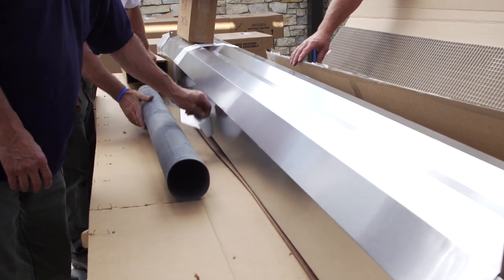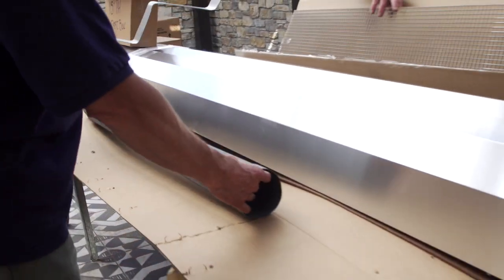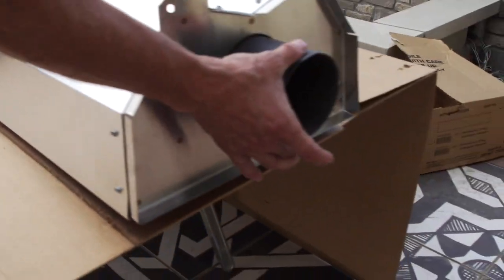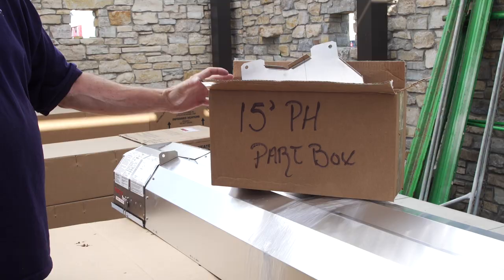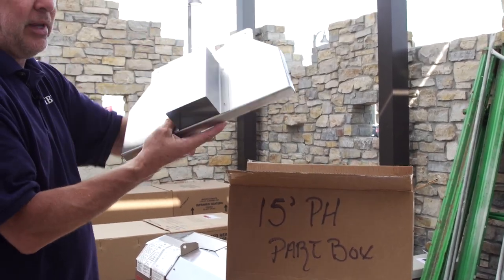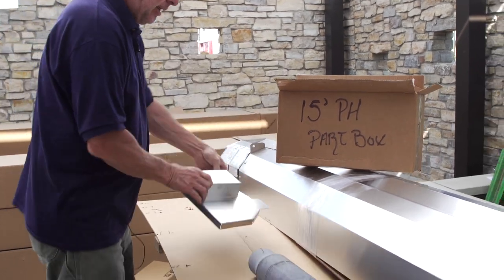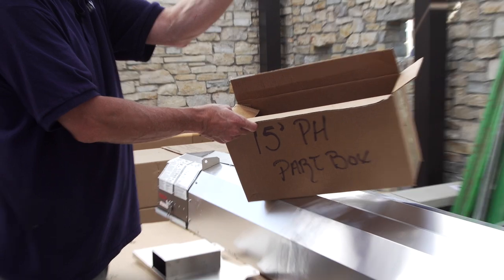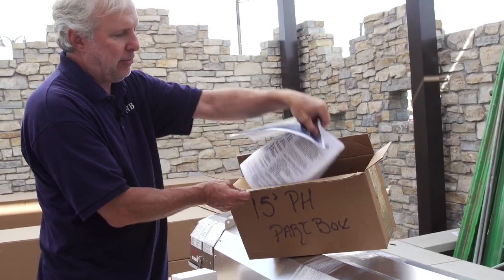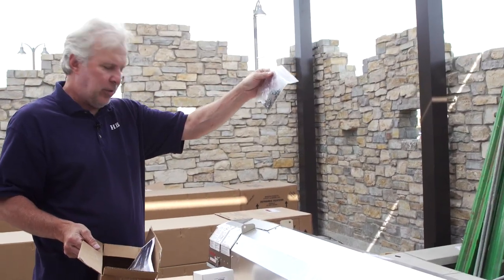Here is our baffle or turbulator, and here is our 5-foot piece of extra infrared pipe. Notice the flare connection on this pipe flares out a little bit, so it easily slides over the pipe that protrudes from the base unit. With the model PHS-50, we have a part box that comes in the main box, and we have our end cap, which will go on the end of the unit once we put our 5-foot extension on. We have our control panel, just as we had with the 10-foot unit, and our instruction and installation manuals. Also, a bag of screws — we'll show you what to do with those.